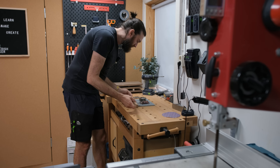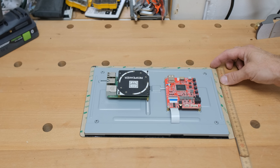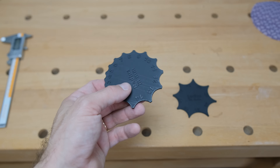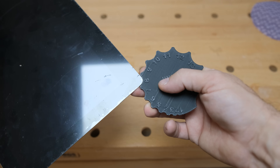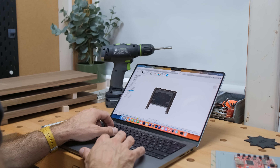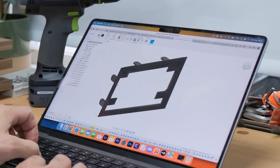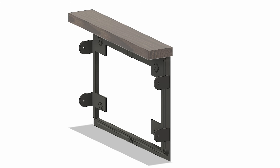The first thing I did was measure the device because I knew I had to make a 3D printed case for the back. This was just a matter of measuring and CAD modeling — I'll have all the resources linked below. A really helpful tool for this kind of CAD modeling is a radius gauge, which tells you what radius was used on a particular edge. In this case, 7 was the closest. I started making a design that could house the display and also give me the possibility to add a wooden frame around it, with standoffs that have holes to attach the wooden frame later.